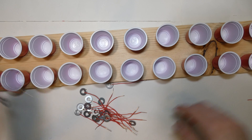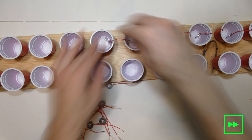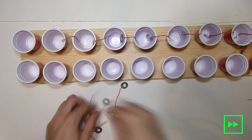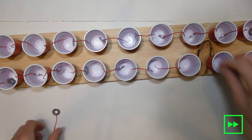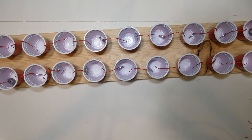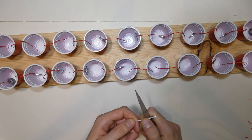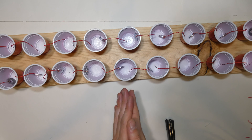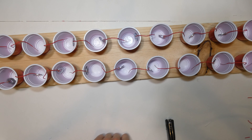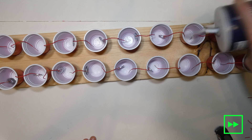We're going to start from over here and go this way. I'll use one extra wire for the other terminal. Honestly, this is the whole circuit right here. You have one of these elements with the zinc on one end and the copper on the other, going from each cup to each cup. The next thing is I'm going to fill it up with some salt water and then we're going to start reading some voltages on it.